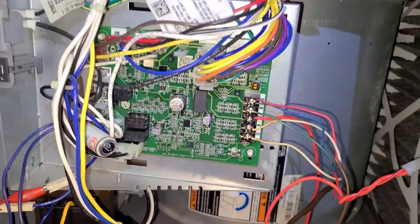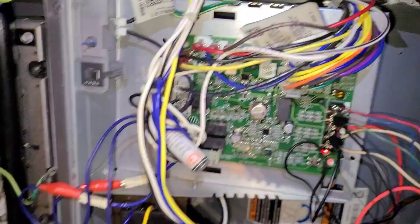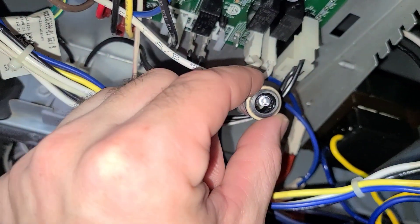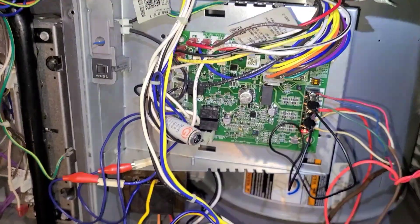I'm about to jump the cooling from the control board to see if it turns everything on. Got the new control board in, got a jump — fan is on, the outside unit is on. Short Pro tool not lighting up, telling you it was just the Y terminal on the control board.